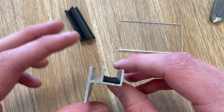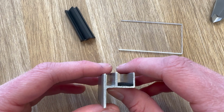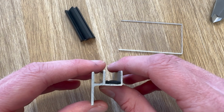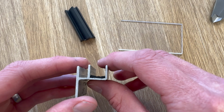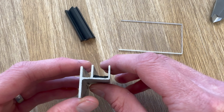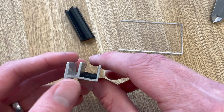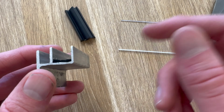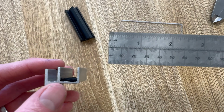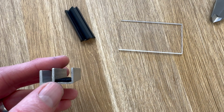This method may not always be possible to do for large UPVC windows where you're unsure about taking a 1 metre by 2 metre window pane out of your house. It is usually best suited for smaller windows such as those in aluminium frames on boats, like those that are fitted into channels such as this. It may be possible on UPVC windows, but I would prefer, and it would be best, to use the previous method of using a ruler to measure the gap just by removing a small bit of one of the wedge gaskets.